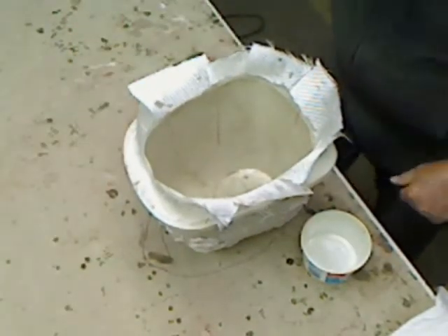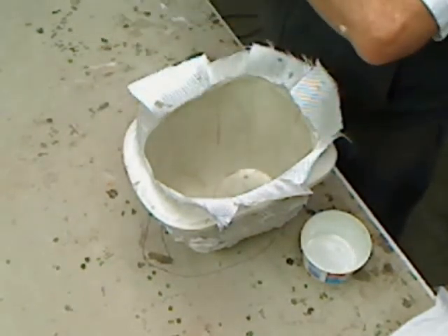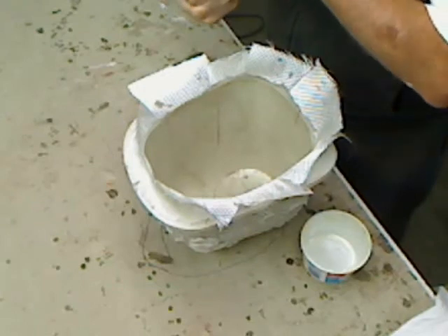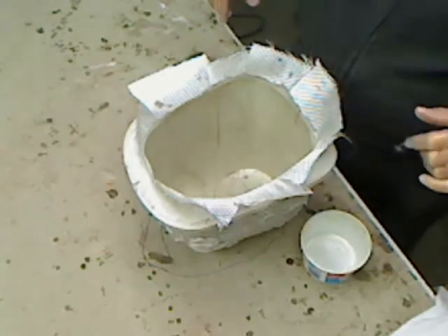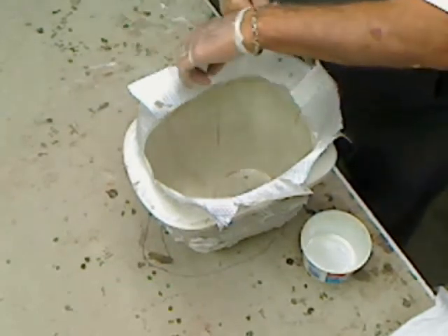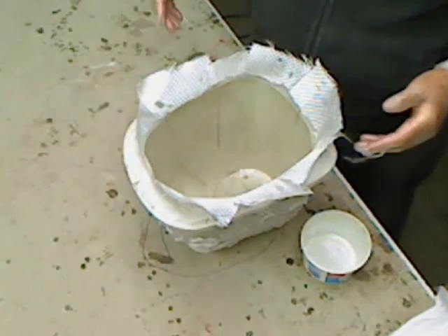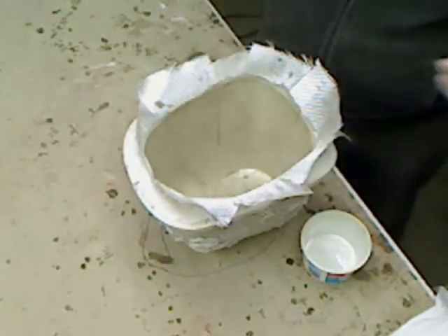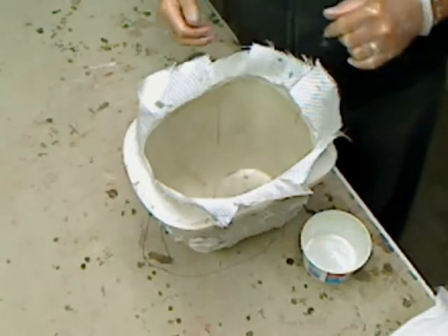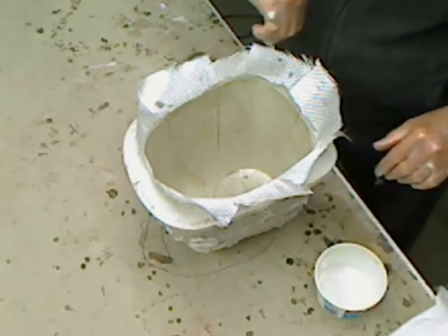That's it for now — we'll let this sit up. I've got my timer set for about two hours. We'll let it get nice and tacky, set up enough that we can come in with a sharp exacto knife and trim this excess off around the edges. We want to do that between coats because once it's fully built up and cured, it's really hard to cut off without something drastic. So we'll trim that off, lay up the next layer, and we'll see you back here in about two and a half hours.